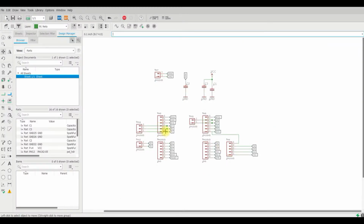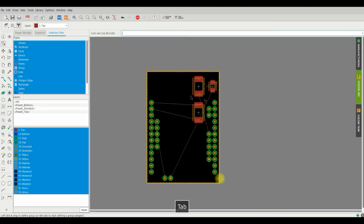I started here with one of the boards that I'd already done. It was the dual motor board, because that already has the pins at the right spacing for the version 4 control board. We already have some of the output pins in position here. We might need to add a few extras that we're not using now for the other motor drivers. One of these two is the PWM for the second channel that we were using on the TB6612FNG chip. So if we're not using that, we can add that as an extra PWM output, which is pretty useful. And because we're only using one chip, we might be able to reduce the size of this board.